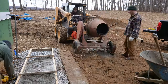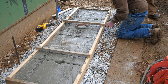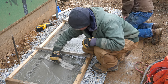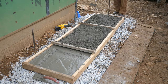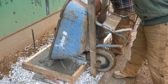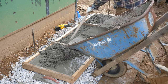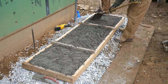It was rinse and repeat for the rest of the eight bags it took to fill the form. Once the form was mostly filled, we slid our rebar in and worked it into the mix to about the halfway point. I had already marked on the forms where the rebar needed to go, making sure it didn't intersect with any mounting foot locations from the unit manuals. The amount of water called for on the bag seemed not quite enough and the mix seemed sort of dry, but once worked into the form the water came out and it became much more workable. More water means more shrinkage and more likelihood of cracking — when in doubt, follow the instructions.